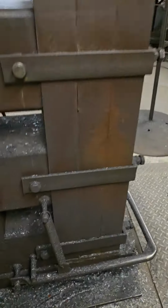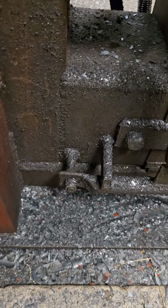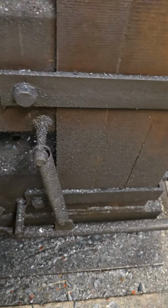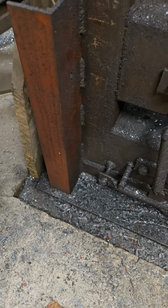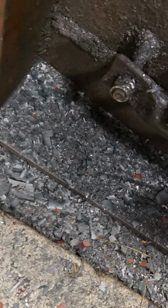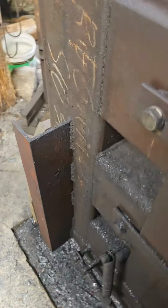But everything down here for the pivots is just real simple stuff. Just weld on bolts, make some pipe for your foot, put some return springs. All this kind of bracing is just really to weld to that thick base plate. Y'all notice I've got a small 1/2-inch plate on the very bottom, then I set that larger piece on top of that. And to tie all that together, I just put some supports there.